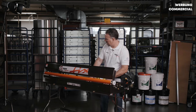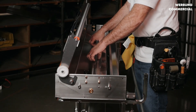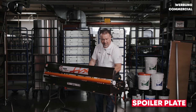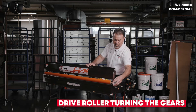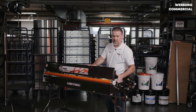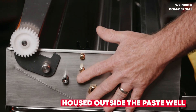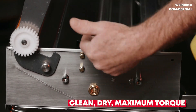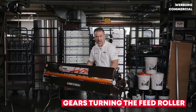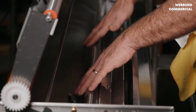Adjacent to the feed roller you have your geared feed roller, and you also have the addition of a spoiler plate. As the drive roller turns the gears within your gearbox — which are housed outside the paste well, not inside, so they stay clean, dry, and deliver maximum torque — it turns this feed roller that is submerged in your paste.